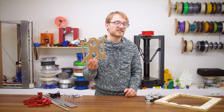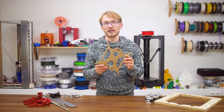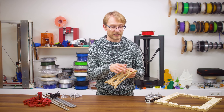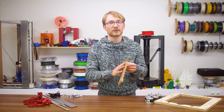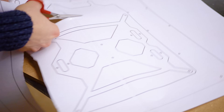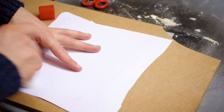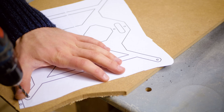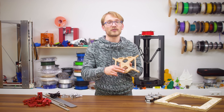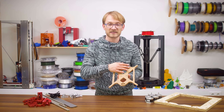You could make the bed frame from the same material, but I went with a 10mm, aka 3/8th-of-an-inch, MDF sheet here, since the bed subframe needs to be a bit lighter and the finer details don't lend themselves to the core structure of the OSB board anyway. So with a fresh printout of the template, you want to start out with the holes — you don't have to be as precise as with the main frame here. Let's look at the way the bearings are mounted.